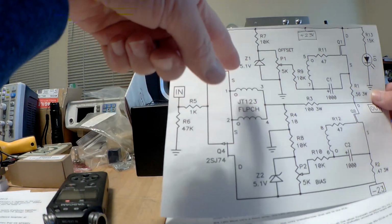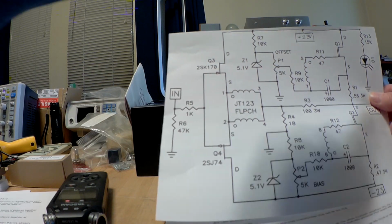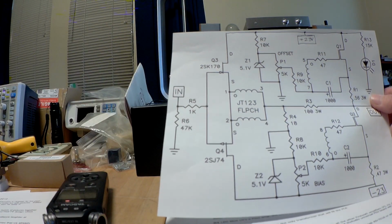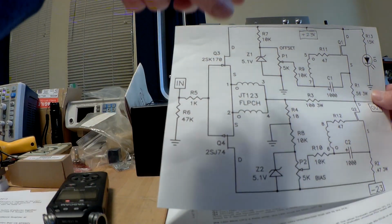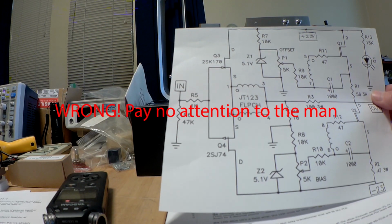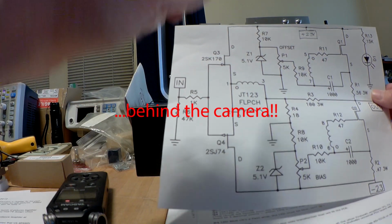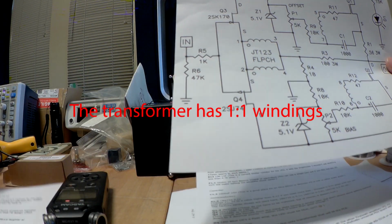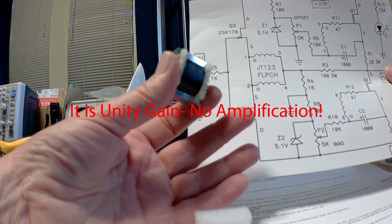And I could see why, because it's a rare beast. It's a solid state, MOSFET output amplifier, JFET input amplifier. Those are the two amplifying stages, JFET in, MOSFET out. But there's a twist to it, and there's a third stage, or at least there's voltage gain being done by this stage, and that's this interstage transformer that Mr. Pass is using. Here's one of them right here. It's a little Jensen guy, has 8 pins on it.